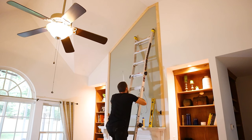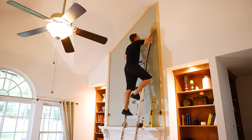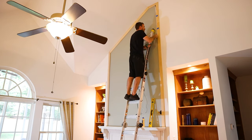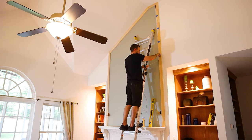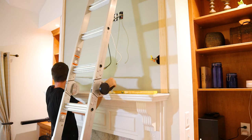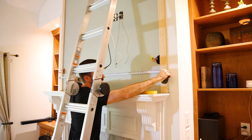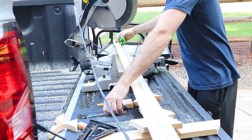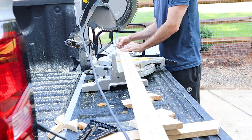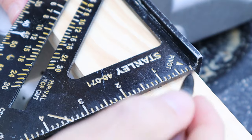With the border now installed, I'll start measuring the width and get my slats cut. The goal is equal spacing — my tall side is 115 inches, so dividing by 8 slats gives me almost 14 inches each. I'm using tape to see how it'll look visually before making any permanent moves. With the border installed I'll measure the distance in between, get to cutting, and follow the same prep steps: cut, sand, then wipe clean.